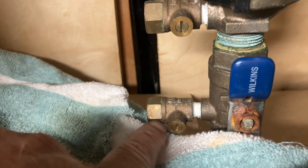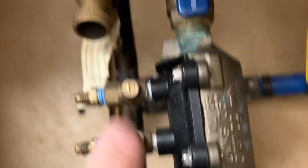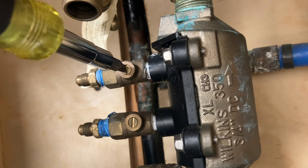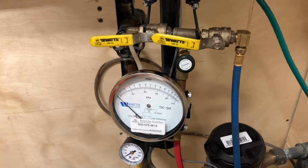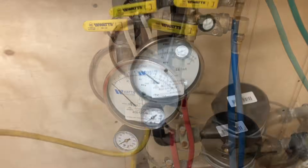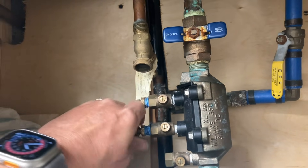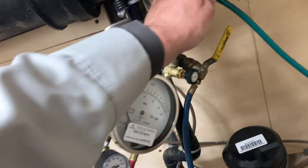This is test port number one, test port two, three, and four. Shutoff valve number one, shutoff valve number two. First thing we're going to do — we have a rag and towel up here. We're going to blow off test ports three and four just to remove any debris that could be on that port. We don't want to mess up this very expensive TK9A. Now that I've closed shutoff valve number two, we're going to hook up our high pressure hose to test port number three. We're going to close the three valves on our testing device.